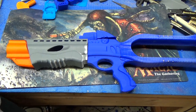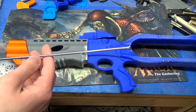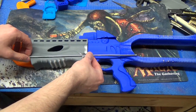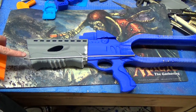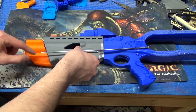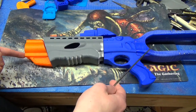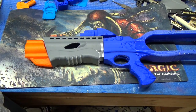The whole shell is now complete. Through my first test fitting I realized the pins I bought were for the original version — they only go out to about here, whereas with the extended nose cone on the front they don't go out far enough. I'll probably just buy some 8-32 threaded rod from the hardware depot or something, put a lock nut on one end so it won't come off, and put my other nut on the other end. But overall, this is shaping up to be a fantastic build.